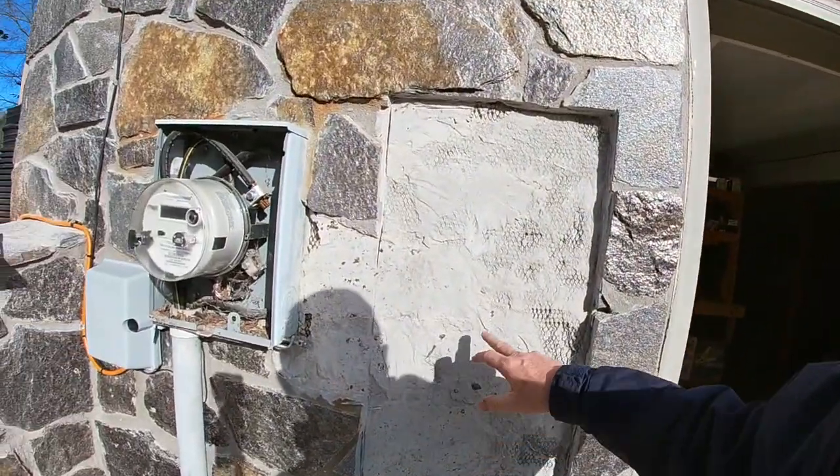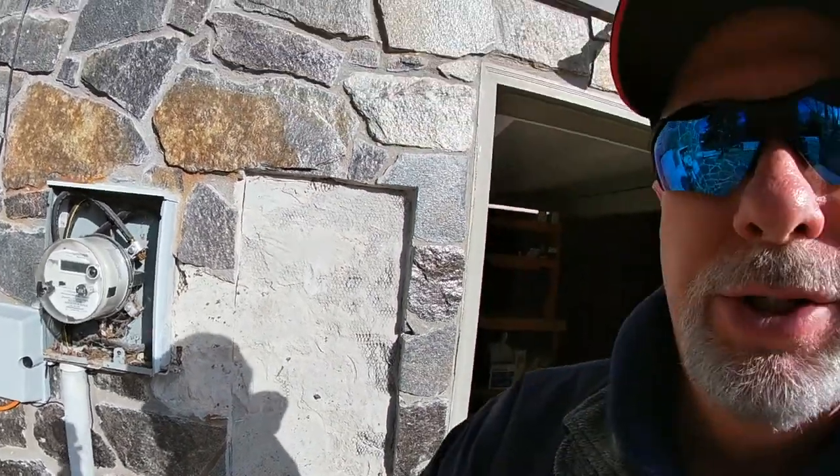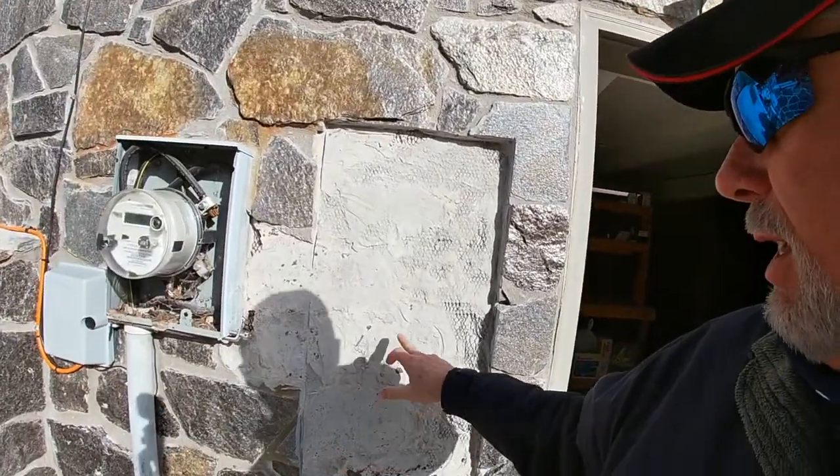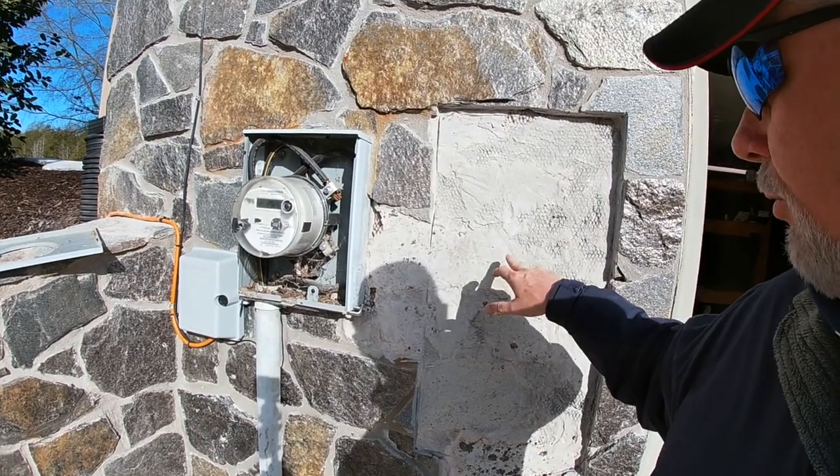I wanted to say thanks for the comments. I had a really cool question: why are they drilling another hole instead of going back through the hole that's already in the wall? The answer is, in Virginia, it's electrical code — you can only have so much wire in a conduit. The conduit cannot be stuffed completely full; there has to be a certain ratio. So we have to do another cutout, which will be a core drill through the concrete wall.